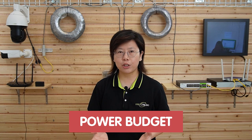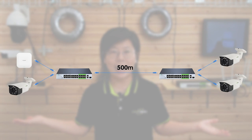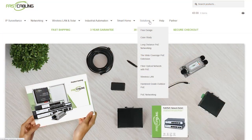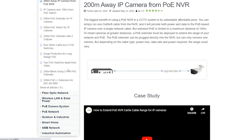We are connecting to a PTZ camera which is PoE-enabled. You should consider the power budget when choosing your device, and if you are using a non-PoE device, make sure you add a PoE splitter to utilize PoE transmission. You can also achieve 250m with no extender needed — just plug in to ports 16 to 24. There is also a special usage: when connecting two long-range PoE switches together, you can achieve 500m and connect with multiple devices on both sides. Thank you very much for watching. Our team is ready to help — visit our solution page for expert assistance with all your technical issues.